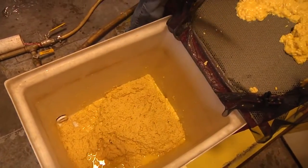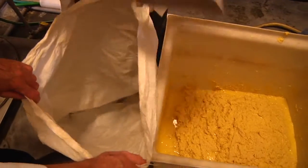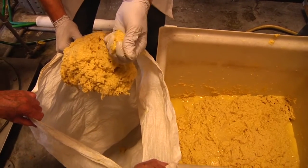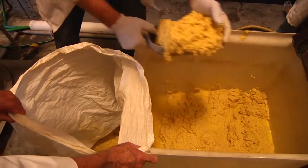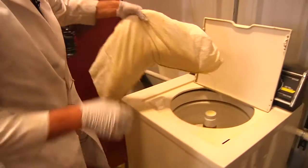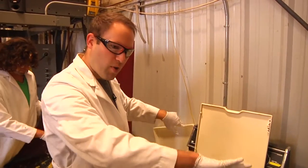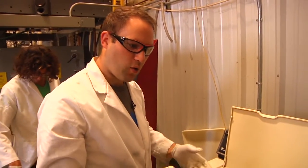We're able to do that by taking it over a slanted screen. Once we've done that, we take the slightly dewatered biomass and put it into polypropylene bags, which allow water to escape but retain the fungal biomass. There's still a lot of moisture in it, so this filtration method removes more water. Then we put it into something we call the fungifuge — basically a washing machine converted into a centrifuge — which gets moisture down to about 75%. The biomass forms an even layer around the bowl, retaining solids while liquid passes through the bags.